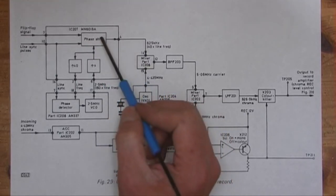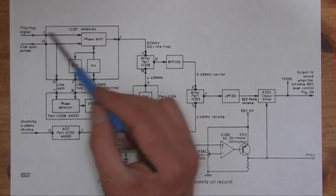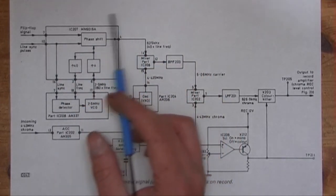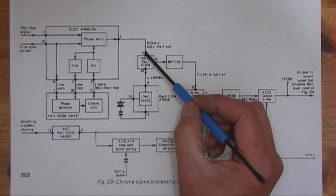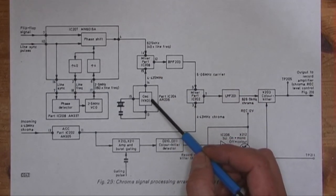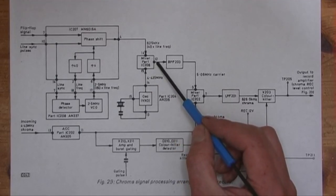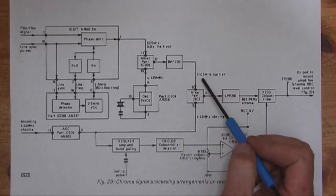This phase shift block is controlled by the flip-flop signal, and that puts back the phase of this signal by 90 degrees each line, but only for one head. That's why it's got that flip-flop signal, which switches it on and off. So for one head it's just normal, and the other one gets phase shifted. So this 625 kilohertz signal goes to this mixer. The other input to the mixer is from this 4.435 megahertz crystal oscillator, so that's mixed in there